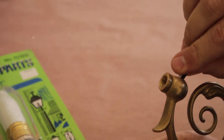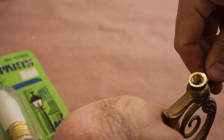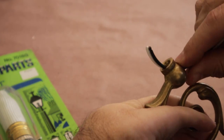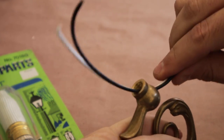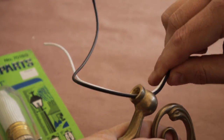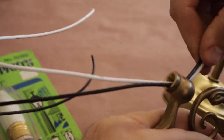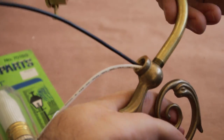The last piece for the lamp arm is to run the cord through the decorative arm back. This corner is tight, so you may want to do one cord at a time to keep from damaging the cord. Once the cord is fed through the arm back, we can screw the arm into the threaded end and tighten the assembly. You'll do this for all four arms and then set them aside.